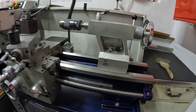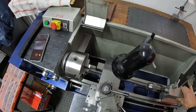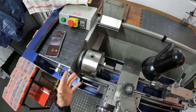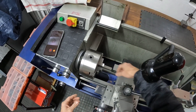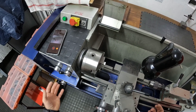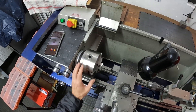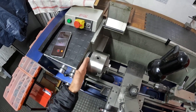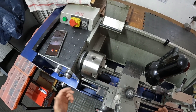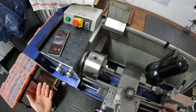I've seen quite a few reviews on YouTube where the guys come and what they do is they put a dial gauge on the chuck and they say, oh, there's movement of the chuck. Look at that — it's 20 micron out. Or what they do is they put a bar in the chuck and they measure it — it's a little bit out. But fundamentally that is flawed. A review like that just means very little. The reason is a chuck has got certain tolerances when they build it, it's backed onto a backing plate, there's bearings in the spindle head, and also a round bar is not 100% round. So measuring 20 micron out in the chuck is just a useless exercise.